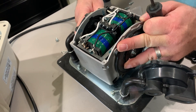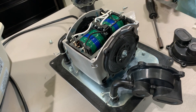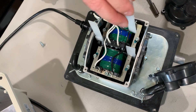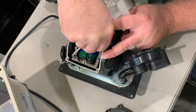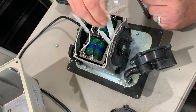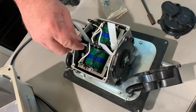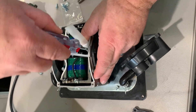I have the other diaphragm over here that goes in. Now I'm gonna take my shims and put them in place, then push the magnet out. The reason I'm doing that is — a lot of guys in our business rebuild a pump and it runs for a while and then stops. The reason is they didn't use the magnet alignment tool — these shims — to properly do this.